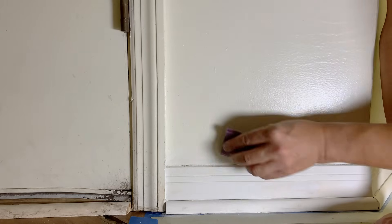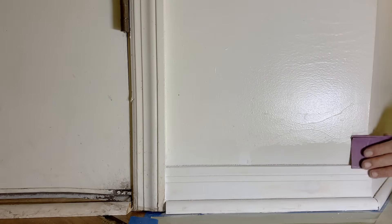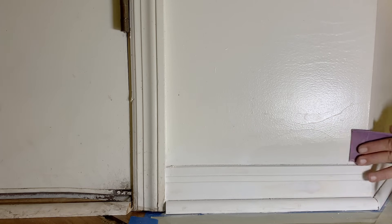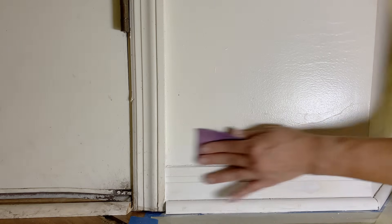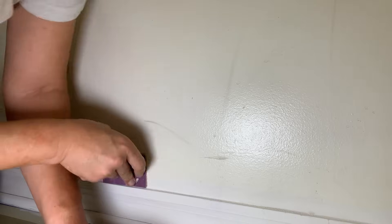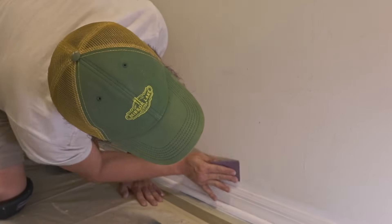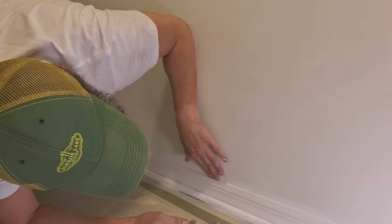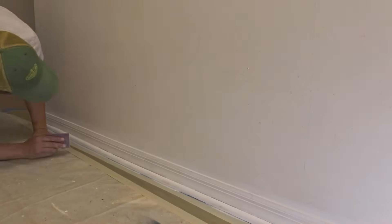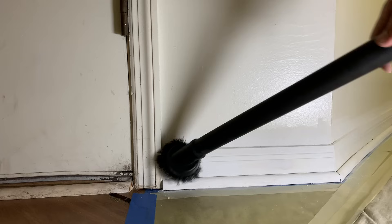After that's done and had time to dry, I'm going to start sanding the drywall patches. Same approach — I'm coming at the edge of the patch and feeling with my hand, making sure the edge is smooth. When the edge is smooth, that's when I go down to the main body of the patch. Work my way down the wall feeling as I go — it's important to feel with your fingers, making sure it's smooth to the touch. Then vacuum again — just made more dust.